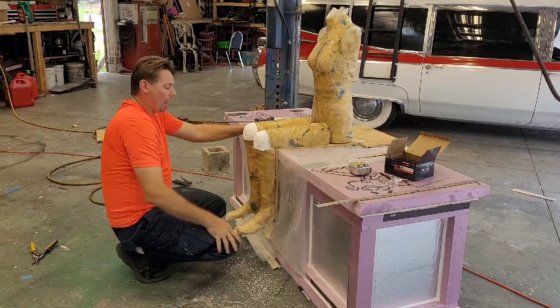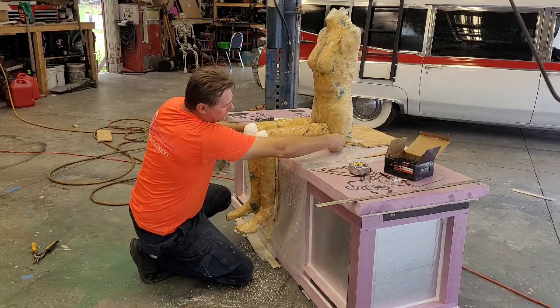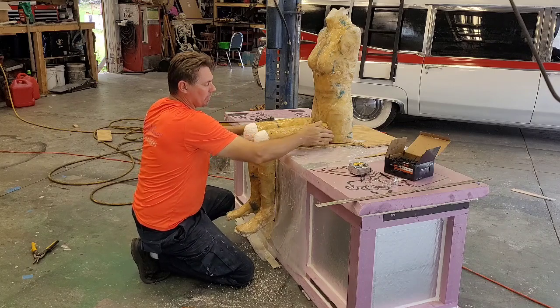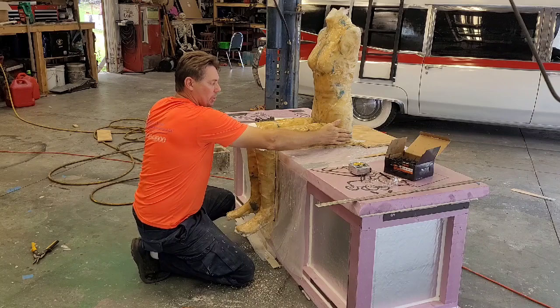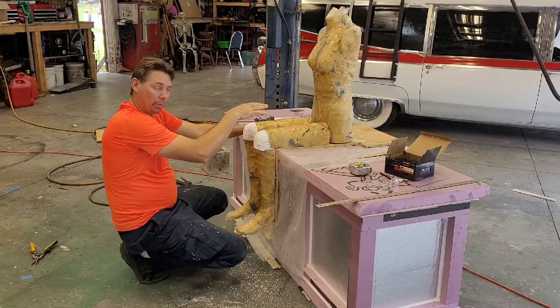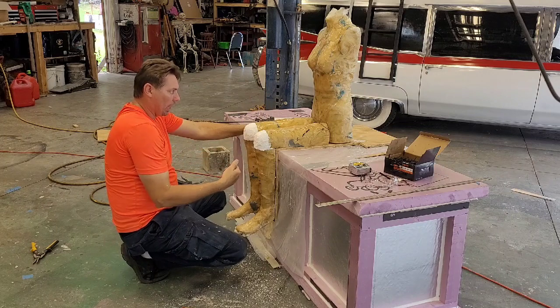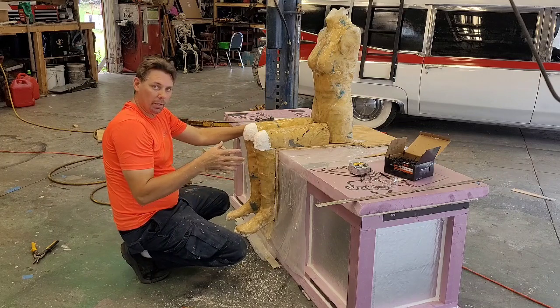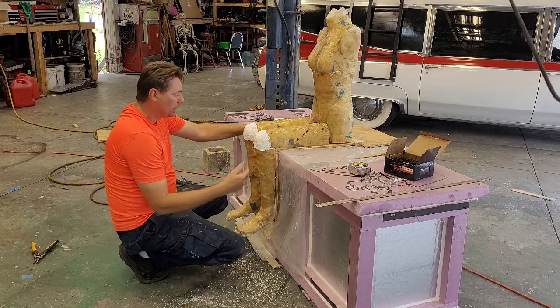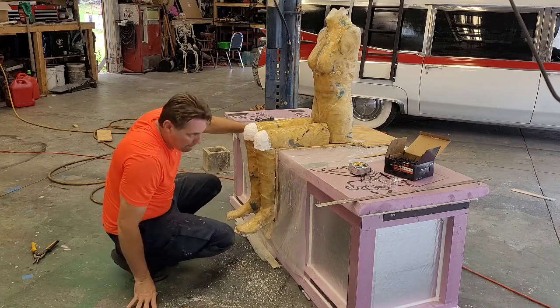And then I'm probably going to take a little bit of masking tape and go from here to here, up this area, so this way I don't have a sink in. So this way I can get a nice transition across here and that side. And I'll lay a couple layers of fiberglass there and here. What that's going to do is completely re-strengthen the whole corners again. Plus, it's attached to the board in the back. So I'm going to start working on the fiberglass.